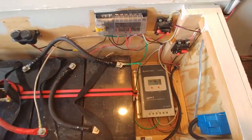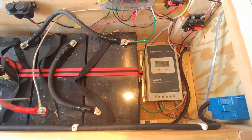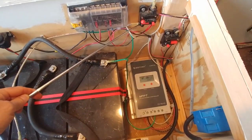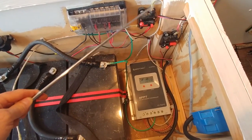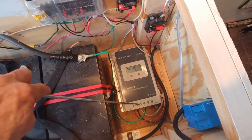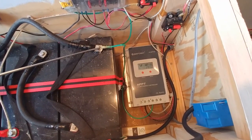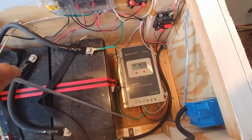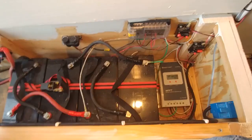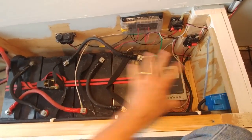I've added two wires to attach the batteries to the solar controller. I'm using white and green rather than red and black to eliminate confusion. A white wire from the positive post runs around to another 40 amp breaker, then on the other side of the breaker the white wire runs around and attaches to the positive battery terminal on the solar controller. For the negative side, I've got a green wire for the ground, attaching to the negative side of the battery, running down and around to the negative side of the solar controller. So now the batteries are connected to the solar controller and the solar panels are powering the battery.